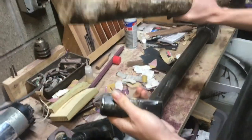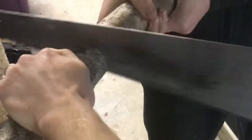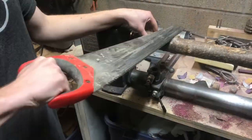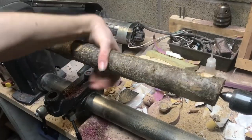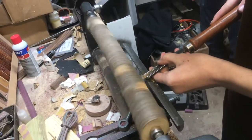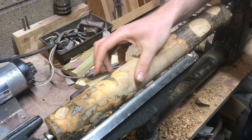This hammerhead needs a handle and this apple wood will do just the trick. I like this length, so we'll go ahead and trim it down. Now we're going to balance it out on the lathe and make sure there's not too much wobble. It's pretty stable on the ends but there's a lot of wobble in the middle — it's slightly bowed. I'll go ahead and knock off some of these high spots to save time. You can see it knocked off a lot of the big stuff; there's still a lot to turn to get down, but it should be easier from here.